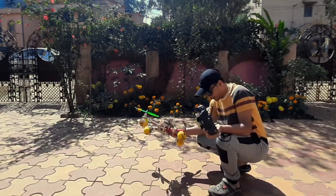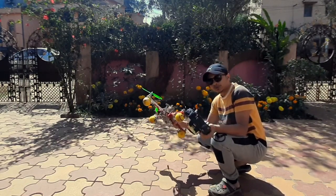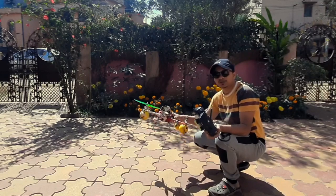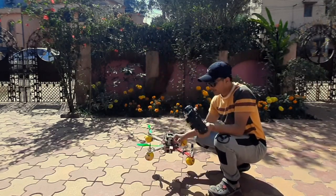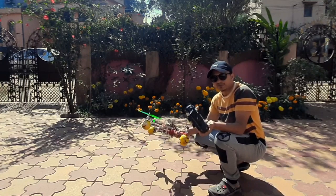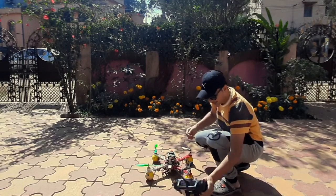I can tell that the total thrust is approximately 1.3 to 1.4 times the weight of the drone. Probably I can go up to 1.5 times. My drone weighs exactly 1 kilo, so I'm getting a maximum thrust of approximately 1.5 kg. That's it guys, thanks for watching — do subscribe and like.